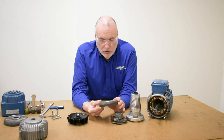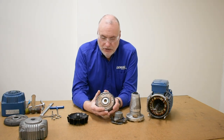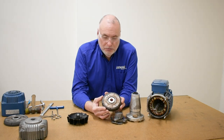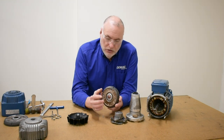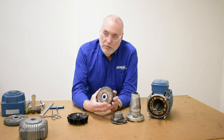A new brake set comes with a new hubcap, a new brake disc with pre-attached lining, and a new bundle of shims — this is the replacement part. When you run out of shims, you'll notice that you won't have any of the cleaning grooves left. So replace this assembly.